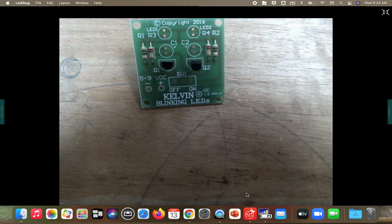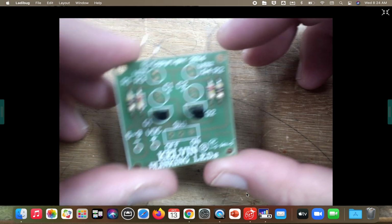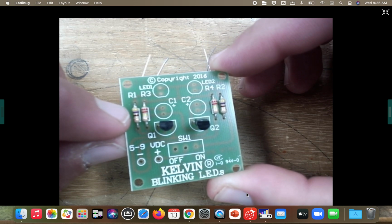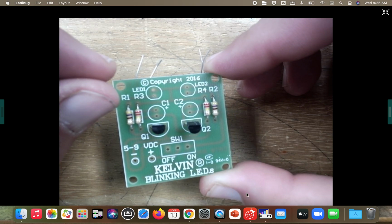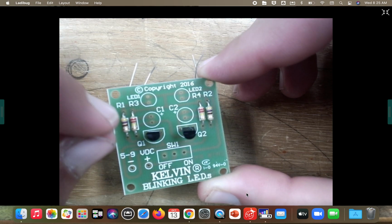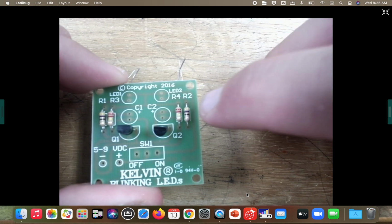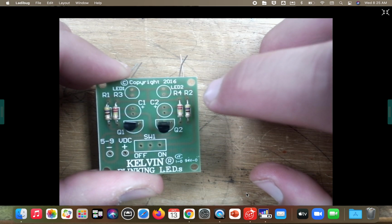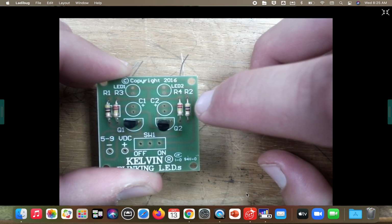Our 4 resistors in. Okay, so just to double check your progress from yesterday, you should have your yellow, violet, brown in R1, and R3 should be a red, red, yellow. Make sure that in R1 the yellow band is on top. In R3 the red band should be on top. Then we switch over to R4. The red, red, yellow is in R4, red band on top. And then R2, yellow, violet, brown, with the yellow being on top.